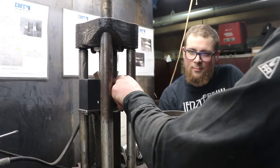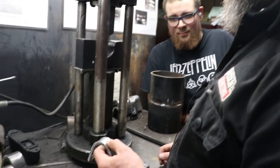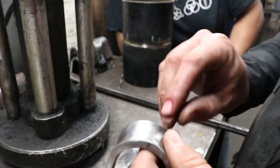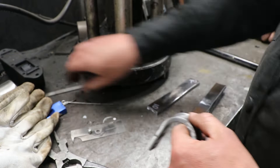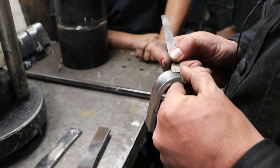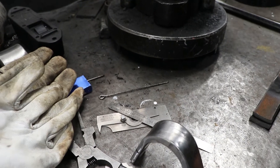What we bent here is the root side of the uphill weld. We can see there's one flaw, and we're allowed an eighth of an inch — so we're good so far. Now this is the root side of the downhill weld.